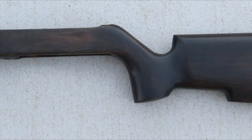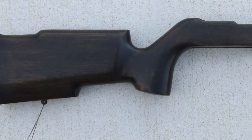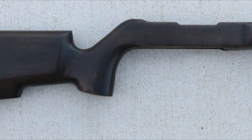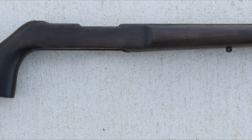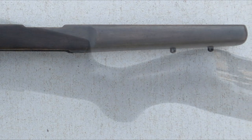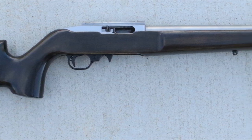With minimal sanding to begin with, the wood was very porous — very thirsty. It sucked up the stain on the ends of the laminate where the grain was exposed, just pulling in an incredible amount of stain. So you'd get really dark end grains and then it didn't really take as well on the side pieces, which I thought looked really bad. That was a little better after I put coat after coat of stain on. I went dark, then sanded to try to go light, then that wasn't working, so I went dark again. It came out looking like black walnut, which I thought was actually pretty cool.